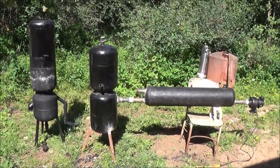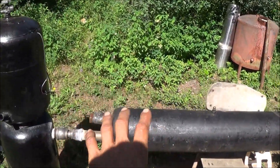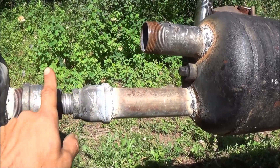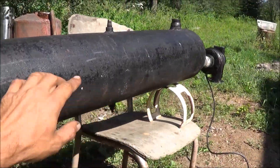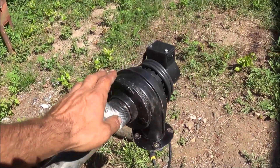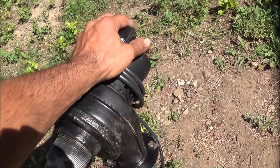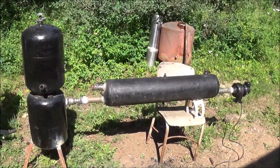We're going to do a quick test fire-up of our little mini gasifier that we just got done building. You can see here I've got my water tank ready to go. This is, I think, a pressure tank — an air pressure tank. I've hole-sawed a couple holes in there. That's a 1-and-a-half-inch piece of pipe going all the way through. I've got a coupler hooking it to our gasifier here. The wood smoke's going to come out of the gasifier, go through that pipe through the middle of this tank. We're going to fill that tank full of nice cold water, and then the smoke's going to come out here and into our draw fan. I've reversed the fan around that we had on the larger one, so now it'll actually create a draw — you can feel the air blowing out here. We're going to fill it full of wood and give this our first primary test fire-up.